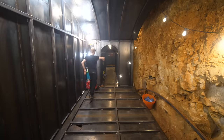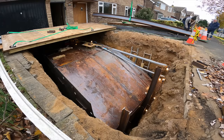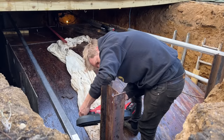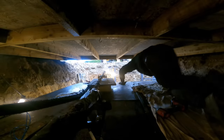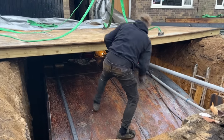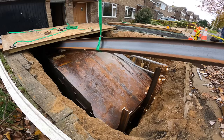This room is complete as much as it needs to be for the time being - it's looking absolutely fantastic. You could fit a car in here already, but there's another job I want to do before pouring any concrete: I want to put the RSJ beams across the top of the roof to properly brace the outer walls, because concrete is heavy and I don't want the roof creaking in or warping. We've got a nice big 600 kilo RSJ to swing in somehow. Before we swing the horizontal RSJ in, we've got to cut the vertical ones down to level using the bandsaw and plasma cutter, then delicately thread the 600 kilo beast underneath the remaining cover and onto the RSJ verticals.